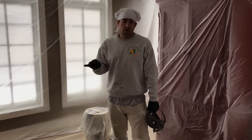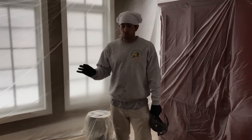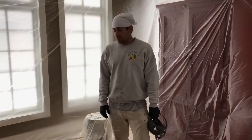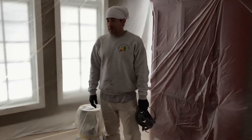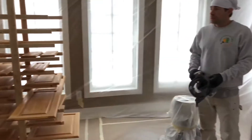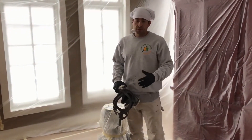Alright, we've protected all the homeowner's stuff and put up several zip walls. We've washed all the cabinets as well as all the doors and drawer boxes, sanded them and deglossed them with denatured alcohol. Now we're going to prime them. We've double-layered the floor with paper, put a layer of plastic in between, and set up a zip wall with a fan going outside in the area where we're spraying — about the size of a small room, 15 by 10. We've got our door rack and spray booth set up. I'll do a quick demo of the primer we use to show you it doesn't create a lot of overspray and you can keep the smell and overspray to a minimum.